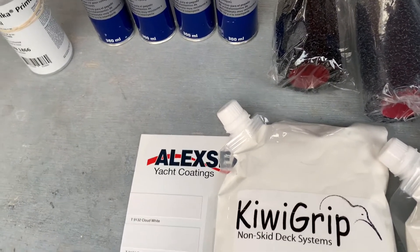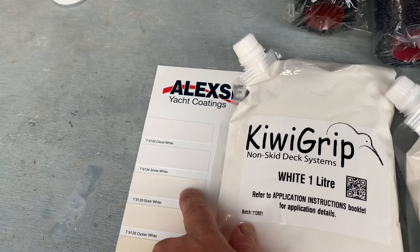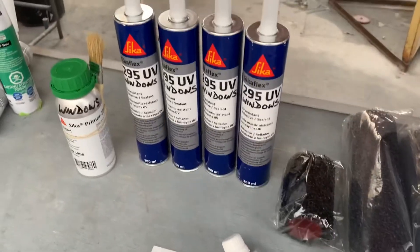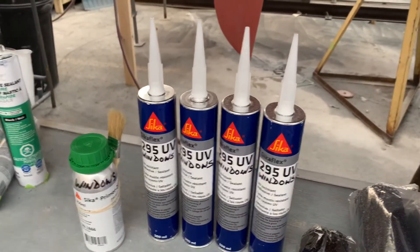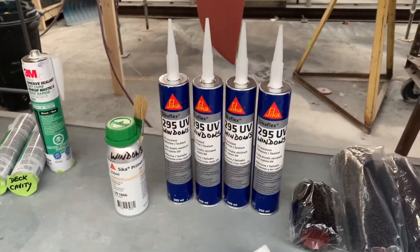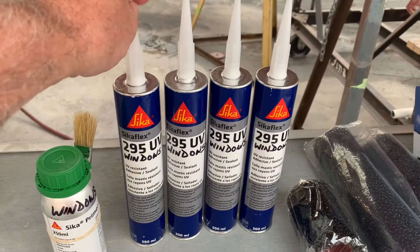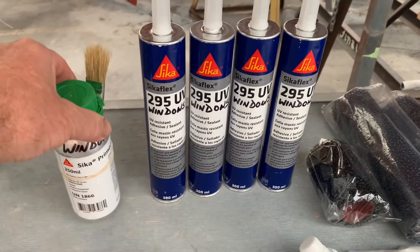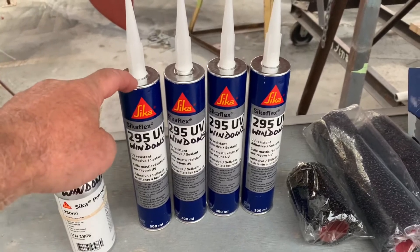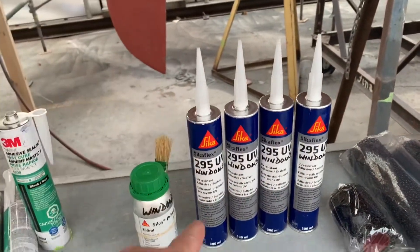Last night everything had tubes and stuff here, so I had to mark it — make sure you're using the right product at the right time. We're using Sikaflex 291 white for the deck fittings. Once the kiwi grip goes on, some of the fittings that go on top of that we're going to be using the mildew-resistant silicone — clear and transparent. The kiwi grip now comes in one-liter bags. We're using stark white for the color of the boat, so we're going to take it down to Sherwin-Williams to see if we can soften and tint it closer to stark white.